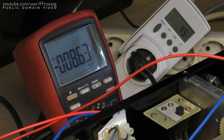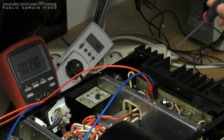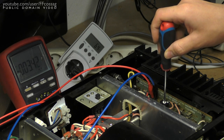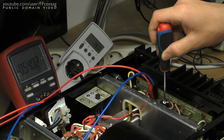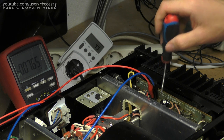Quick correction: the bias is actually rising as the temperature rises. So I readjusted it to be slightly below 10 millivolts just to give us the best chances at one-shotting it. I noticed while the amplifier was sitting that it was starting to drift a bit on the current on this channel. If I go ahead and give this potentiometer a bit of a twirl, we come across a dead spot. This potentiometer was being rather dicey in a certain spot — it's probably worn down from fiddling with it. That's enough for me to want to replace that potentiometer.